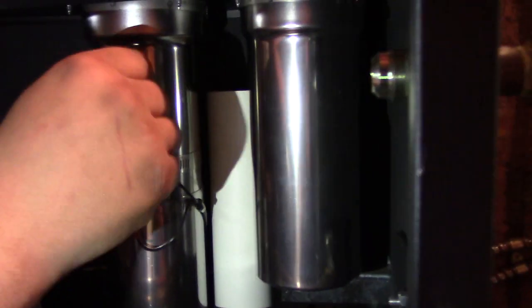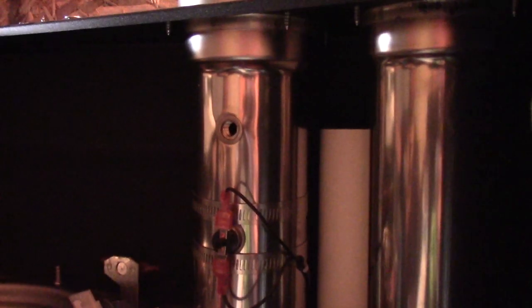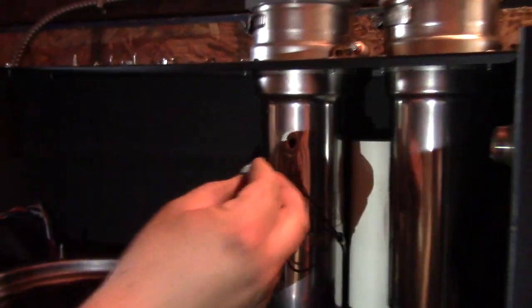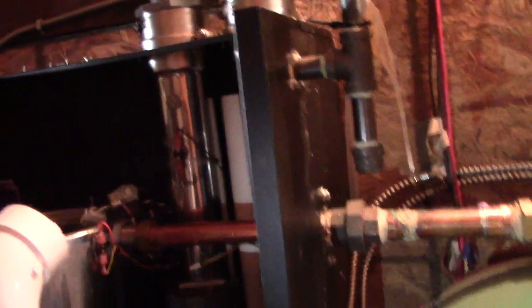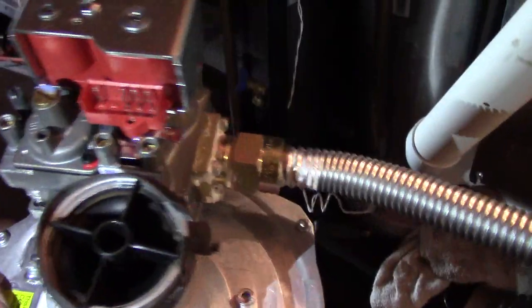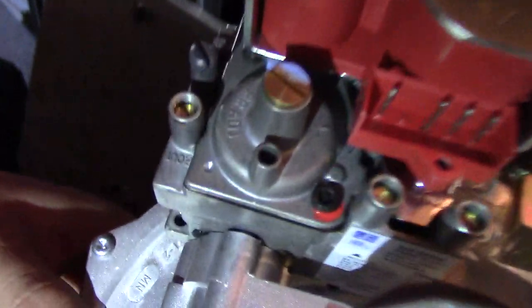There's also a pressure sensor here that gives a value to the board to modulate fan speed, and will automatically detect the altitude and adjust the burner accordingly for proper combustion. For testing combustion, there's a factory threaded hole in the unit where you can put your combustion analyzer. Run it on high and on low — in the manual there are target O2, CO2, and CO values for both. Once you have high and low dialed in, the unit will modulate between those points. The fine tuning adjustment is a set screw on the gas valve itself. Then it's just a matter of putting this back together.